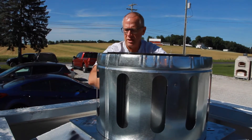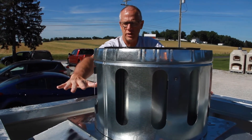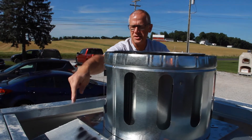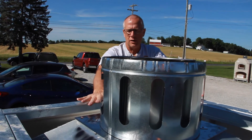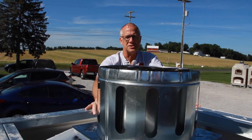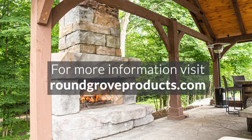If this was just an 88 inch tall unit we would have wall board pre-cut with the hole already cut in it that you would set down on top of this and then screw down into the steel using a one inch screw. We don't have that today. Next we're going to show how to install the chimney extension onto this unit and bring your flues together — that'll be on the next video. Thanks very much. Delighted to have you as our client and we hope to do business with you more. I hope this video answers any questions you might have about what's included with your purchase as well as what to do when the unit arrives on site.